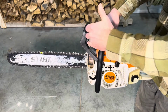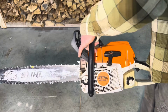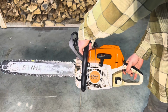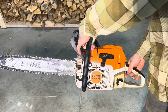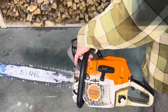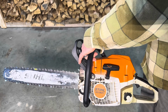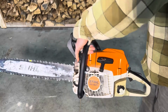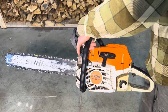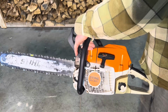So as you grip with the proper hand, and I hope this shows up well on camera, into the corner of the saw, when you hang onto the saw properly like this, again, my ergonomics is bad for the video, but so that you can see the orientation, when I'm hanging on the saw, the orientation to the ground of the bar is actually about 70 degrees, so that the comfortable grip in the corner of this front handle is designed to help begin and set a proper open face felling notch.